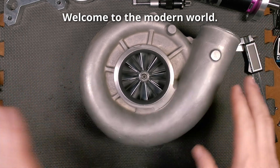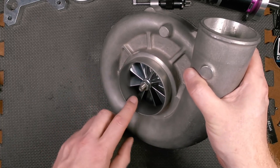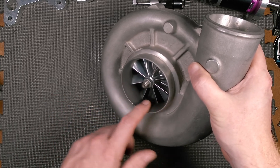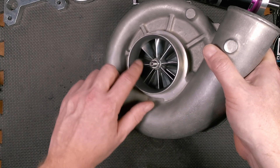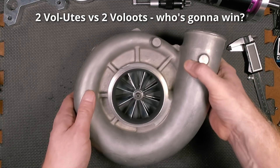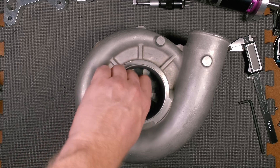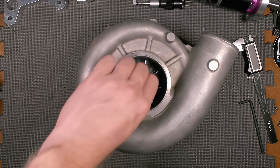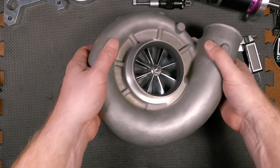Maybe a little hard to distinguish the various shades of gray, but this is actually a dark gray, almost black, and it has a really interesting texture. It's a lot smoother than I expected. I can tell already that the clearance between the impeller and the volute is actually very, very tight. There's a little bit of interference in there, but I expect there to be — it's supposed to be self-clearing. That's the whole abradeable coatings part.